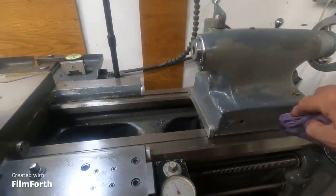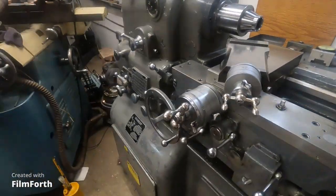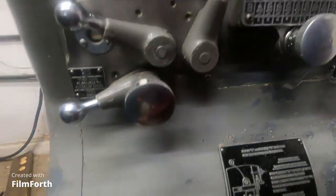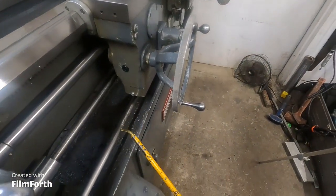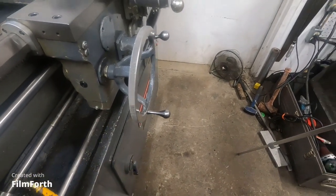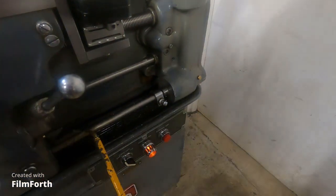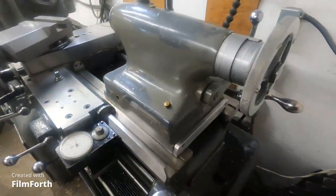Now Bill also — look at that, there it is. This is a good idea too: you want to give your control rod here a bunch of oil, and your feed rod. And if we're going to use the lead screw, that needs to be cleaned. Bill puts a little bit back here too — just make sure, if anything, it'll prevent rust.